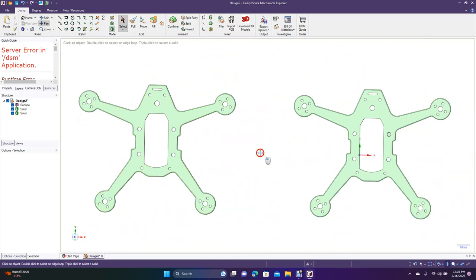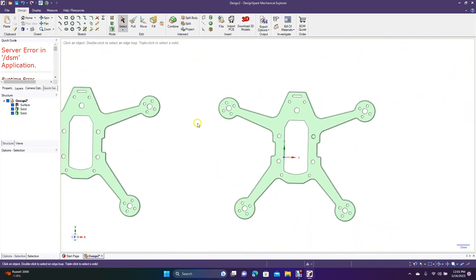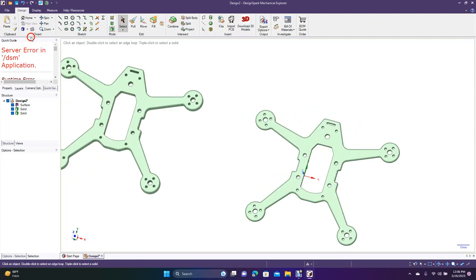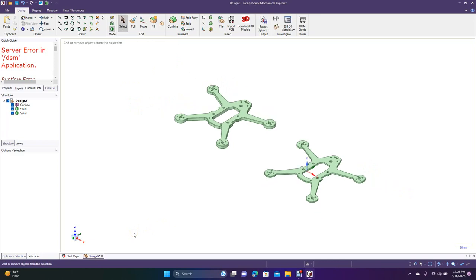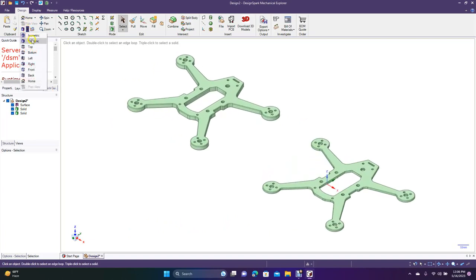It's okay — I'm going to leave it. Everything else is fine except for that, so it should be okay. I only need one of these to make the model. If you were creating this, I would suggest: before you print, save your file out as a DXF, bring it into a program like CorelDraw, and cut this pattern out — maybe thick matte paper in a laser cutter. That way you can make sure everything's going to fit. Then if everything does line up, go ahead and buy your motors and the little pieces to create your drone. That's going to end today's tutorial — hopefully you got some interesting tips out of this video. Thanks for watching.